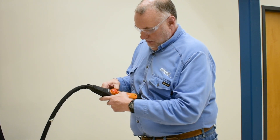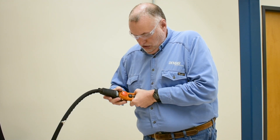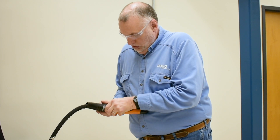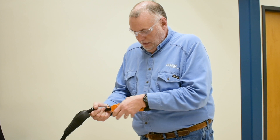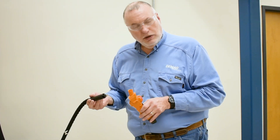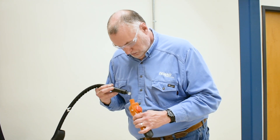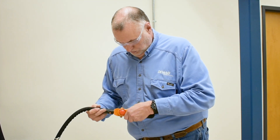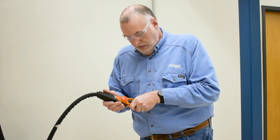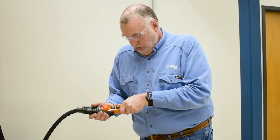Undo the covers over the ears of the anti-kinking sleeve. Pull that up, undo the twist lock, and there's your plug. When you put it back together, make sure the plug is seated — the twist lock will help aid in the seating. Return the anti-kinking sleeve. It may take a little manipulating to get it up over the front top of the push button station.